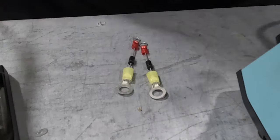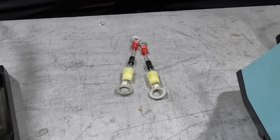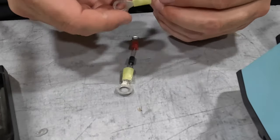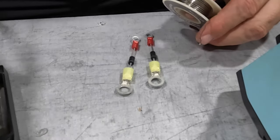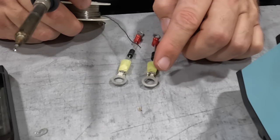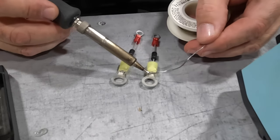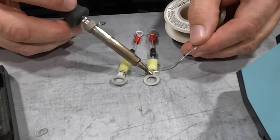I'm making up these little diode protectors for the solenoids. Because of the lug sizes I had, I needed a ring connector that was a little big for the wire. It's crimped on there nice, but I am going to solder these on to make sure we have a good connection. Normally in aircraft wiring they don't recommend soldering because solder can soak up into stranded wiring, makes it stiffer, and can cause it to break. But since these are already rigid, I'm just going to make a solid connection on the end of the ring connector so there's no wobbling.